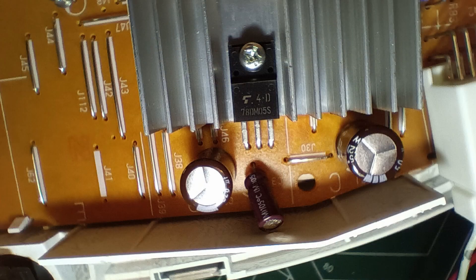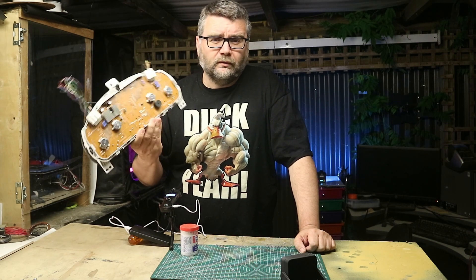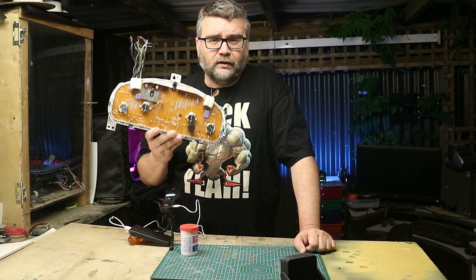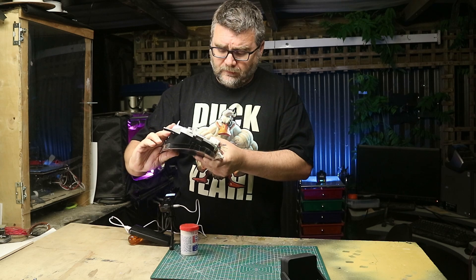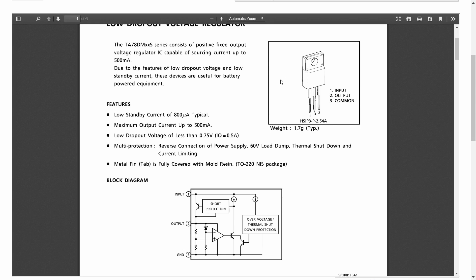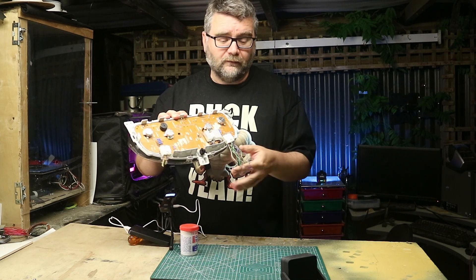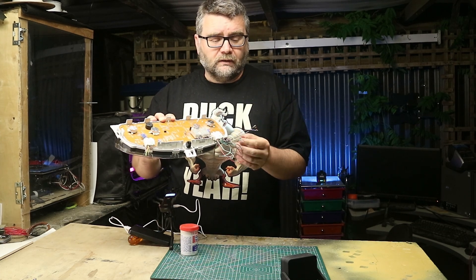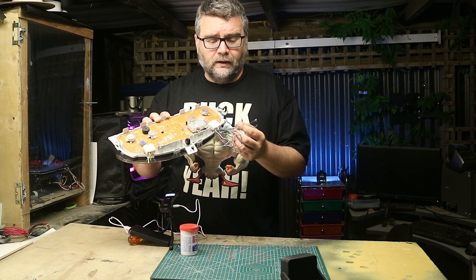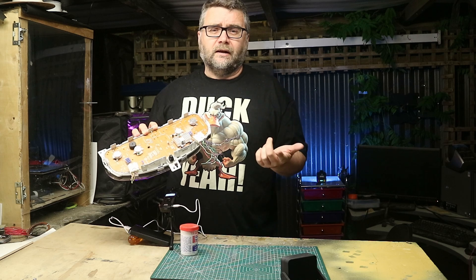This is the regulator for this one here — it's in a big heat sink. For the regulator to work, it's going to have an input voltage coming from the power source, your battery, and the ground. If we can find out where they are, we can power the unit up. This one has got a regulator on it and the markings are quite clear. I took a photo and searched it on the internet, which told me which legs were for the power in and the ground. Once you've got power and ground sorted, we can hook it up to a power supply.